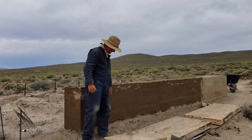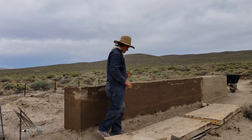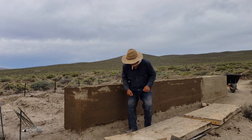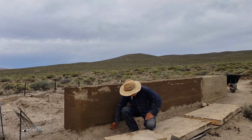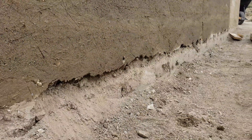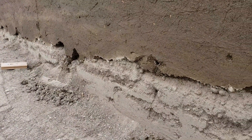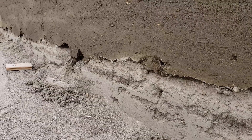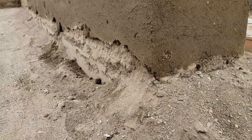The material itself is quite dense and has a reasonably high compression strength, but it has no wear resistance at all. I can really rub it apart — I can't dent it, but I can scratch it right down very quickly and quite easily, and it's not particularly strong. You can see this foundation layer has started cracking and crumbling based on the pressure and the impact from the second layer. So if you're in a seismic area, and I am, this is likely to crumble under the next major earthquake.